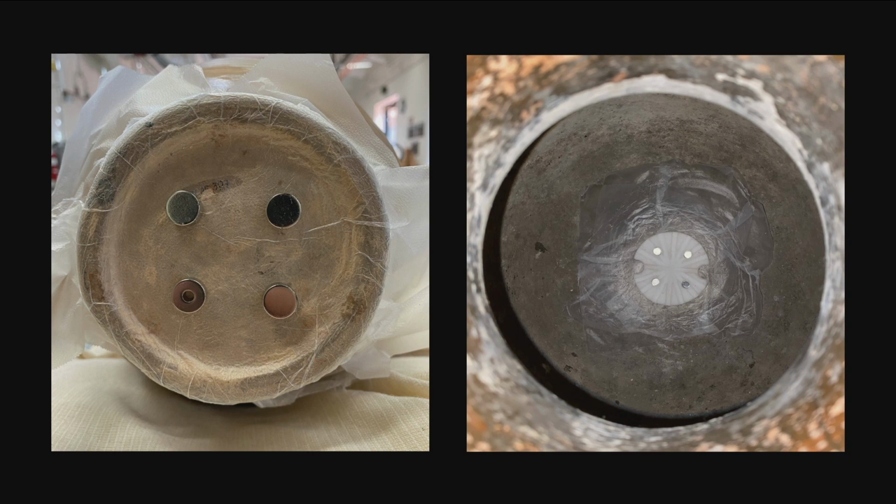But there clearly is a pull force in that the magnets here, this is basically an Ethafoam that has been scalloped out so that it basically can take the concave form of the interior of the body, and then the magnets placed below. So they're being held in place simply through the magnetism here. So you know there is a pull force, but how much? So here, if you say, I need to get to 40 pounds, and this one only gives me 5. Well, it's a help. Maybe I can reduce a little bit, but if I can start actually creating more or start stacking in here, can I get up to that 40?